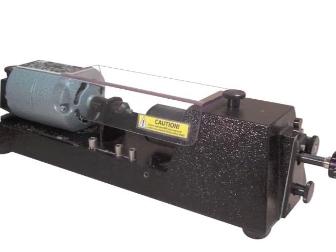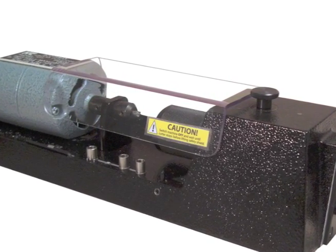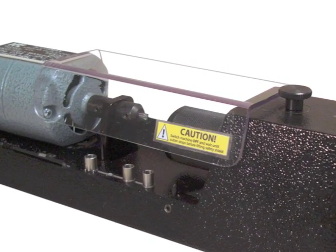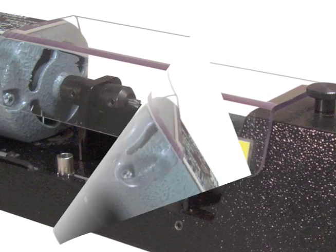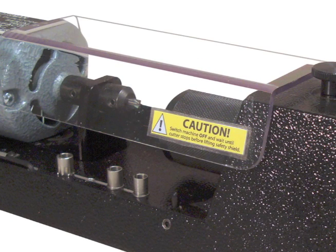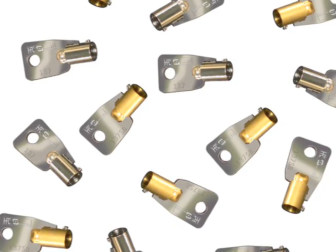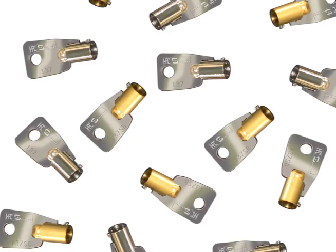The HPC Scotsman Tubular Duplicode is the preeminent tubular key machine. It will cut most of the popular sizes of tubular keys by code, including 7-pin standard, oversized, and small bore. It accommodates right and left-hand offset cuts, dead pin cuts, and pin-within-pin cuts. It also can duplicate a wide variety of keys with any space and depth configuration, as well as create a key from an HPC tubular pick.